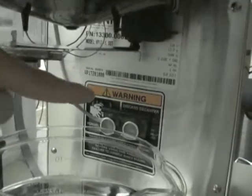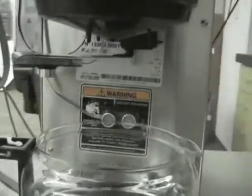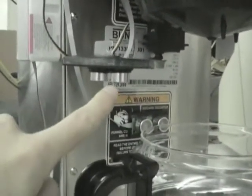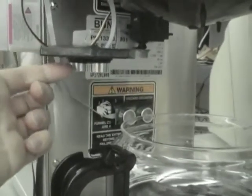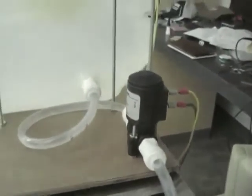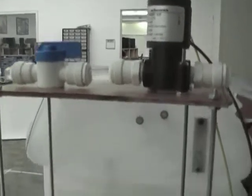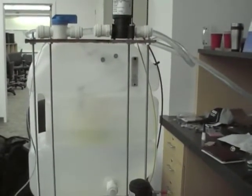Pot Sticker is managing ultrasonic sensors on the front, one of which is used to detect the presence of the decanter, the second of which is used to detect the fill level and is present on the read head. There's also an infrared temperature sensor, which is used to detect the liquid temperature. TankMan has 2 valves under its control and a micro switch, which is connected to a rubber duck in order to measure the fill level of the tank. Essentially, it will click when the tank has reached its full capacity. And then we use timing, since it's a gravity feed, in order to determine how much water has drained out of the tank.